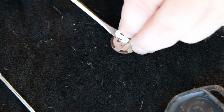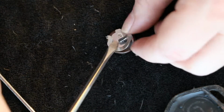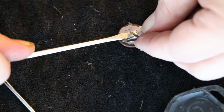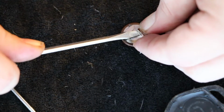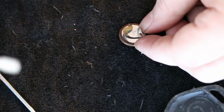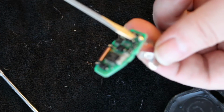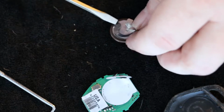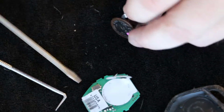The battery that I have isn't going to work now either. I was trying to go immediate repair so that I can just get it done with something that I bought at the local store. Now I'm going to have to order the battery that has these little clips kind of spot welded on there already, and then it's just a matter of coming in and busting those two solder beads loose and then soldering in the new one.